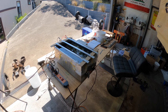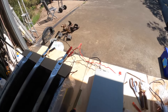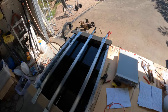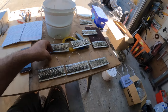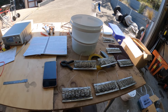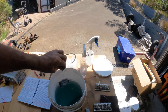One eternity later. Okay guys, it's taken about an hour and a half for this thing to get up to temperature. We're looking at about 52 degrees Celsius in the tank, which is perfect. We've got our rods set up, and also these are the anode little baskets that we had to make — they were sort of annoying to make. We're going to hang those up inside the tank either side on the positive, and then the negative we're going to have our pieces hanging.